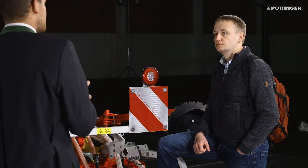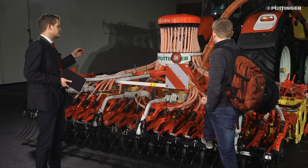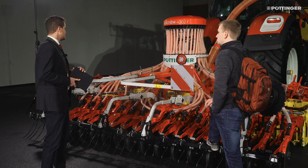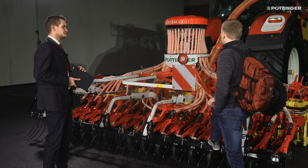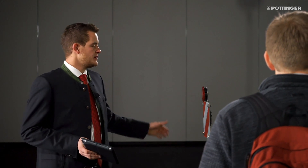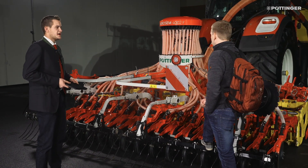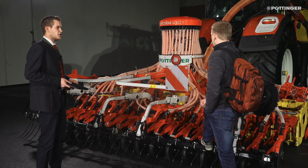Another thing about the distributor head: you can see it's located a bit further forward, but still connected to the coulter rail. Why? So that the hoses are all the same length, which is very important for ensuring uniform distribution across the whole working width. What happens if I want to use the power harrow on its own? We've put a lot of thought into this. There are four connection points between the power harrow and the coulter rail. The distributor head is only attached to the power harrow using the top link, which needs to be released along with the hose to the seed hopper. The coulter rail has four support legs and can be removed within minutes by releasing four bolts with catch hooks — one person can easily do this on their own.